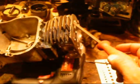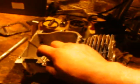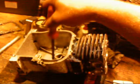Anywhere you tap on the part, you're actually checking the whole part. Even though you're tapping here, vibrations are going all through the part. So if you're tapping here and if you have a crack here, it's going to absorb it. It won't be as loud, and when you get closer to it, it'll sound like a thud. Anywhere you tap, it rings. So that engine block's good.